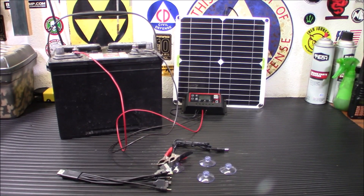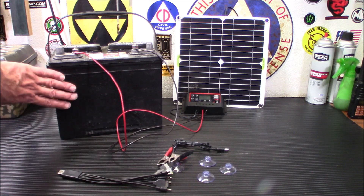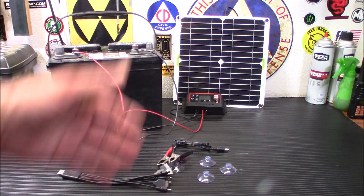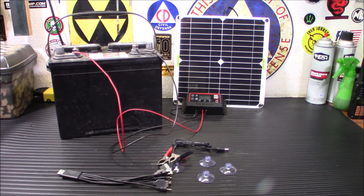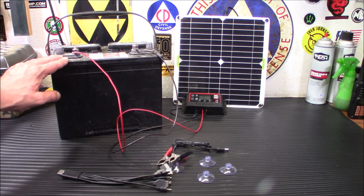If you lived in an apartment without much room and had a balcony, you could just place the panel there and run it inside to a battery box. Always keep it in a battery box and keep flame away — batteries do generate a little hydrogen gas when charging. If you're going to do this with a 300-watt panel, keep it somewhere with no flame whatsoever. You can keep the battery box outside too, but don't keep it somewhere with direct sun and heat beating on it all day.